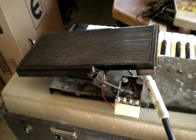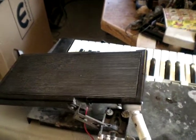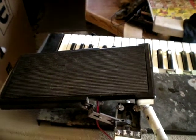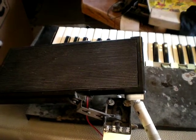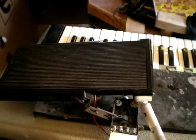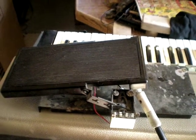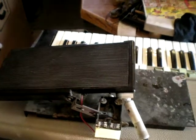and I put the bigger light in, and it gets quite a bit quieter than it did with the small light, the 120 milliamp light. The original pedal calls for a 300 milliamp, I think, bulb, but this pedal had a 40 milliamp 28 volt, so the power is equivalent to having a 14 volt 80 milliamp bulb, so the 120 should have been pretty close to what this had stock, but anyway, the pedal is a different design. Who knows what factors there are therein, the thicker diffusion screen, or who knows.